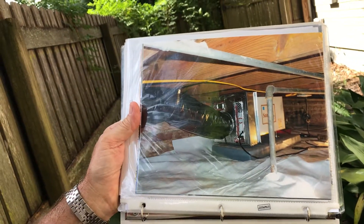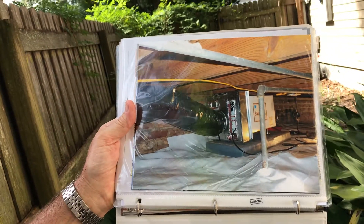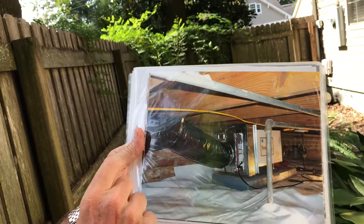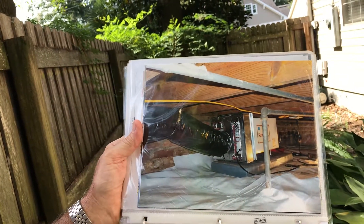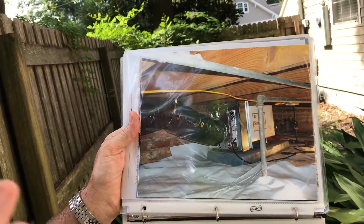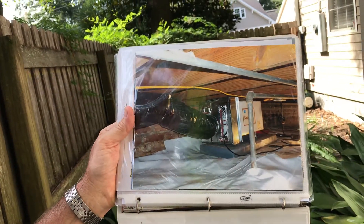The name Turner's Under Seal is a term used for the wood sealer system. We can permanently clean up and seal all the wood, usually after the crawlspace has been dried out, because many of them we work on are very damp. In fact, every single dirt crawlspace is damp, even if it looks dry.